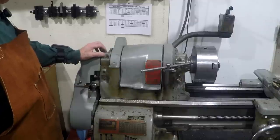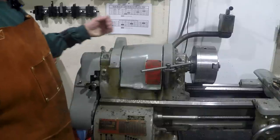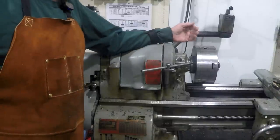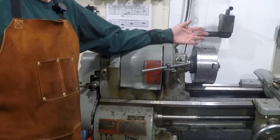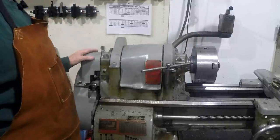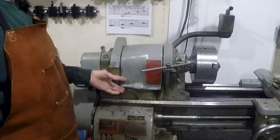We've had a problem that occurred a while back where I have a fair amount of spindle end play. I noticed when I was turning some material that the chuck was wandering in and out. The in and out vibration can give you an uneven finish, or who knows what all. There's an adjustment back here for that. I did adjust it once and the problem came back.